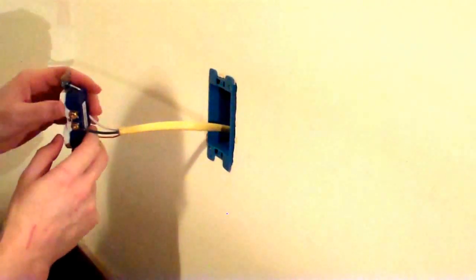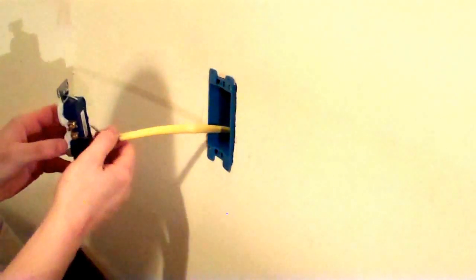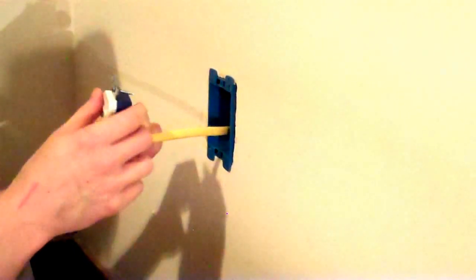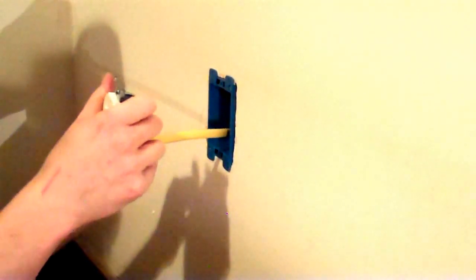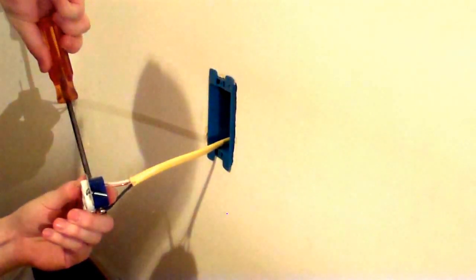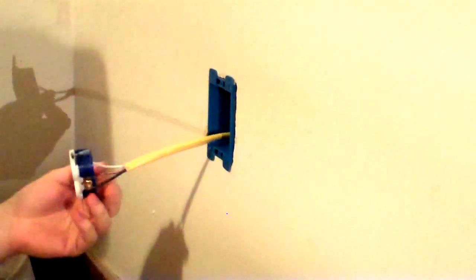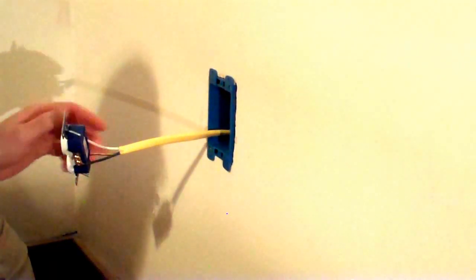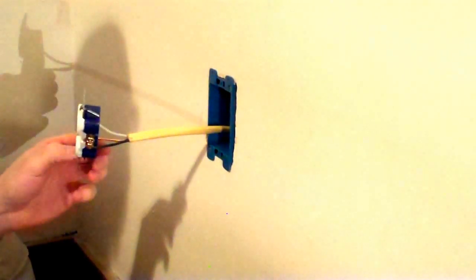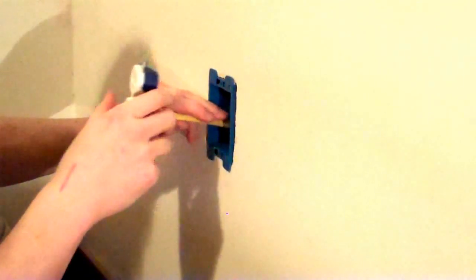It really doesn't matter whether your supply goes on the top or the bottom, unless you're dealing with a GFI circuit. With a GFI outlet, it really does matter which side gets connected where. The GFI outlets are clearly labeled, and most of them have tape over the terminals you're not supposed to connect the supply to, so that you don't accidentally hook it up incorrectly.